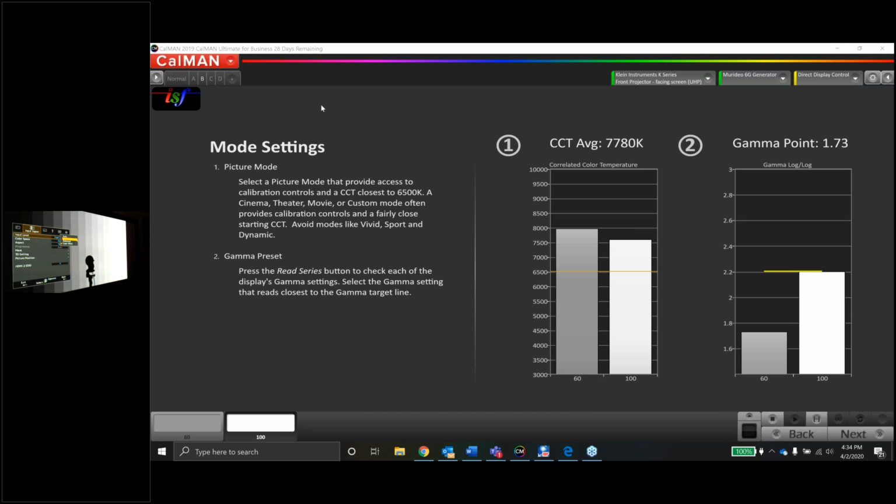Okay, cool. Enhanced is for PC signals only. That'll show you 0 to 255, with black mapped to 0 and white mapped to 255. And then super white still maps black to 16 and white to 235, but will show you the headroom above legal white. Okay, good. We'll see that too when we look at a contrast pattern here in the next couple pages.